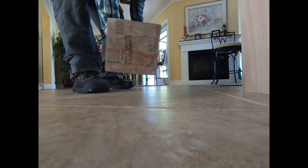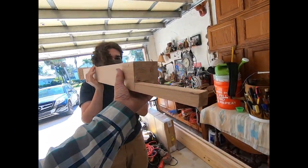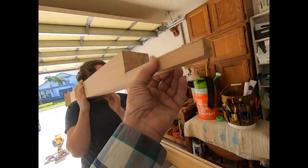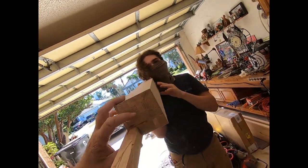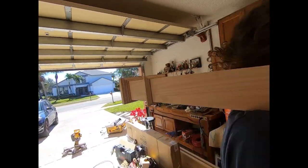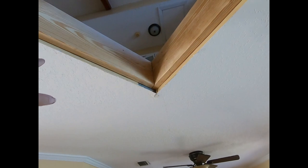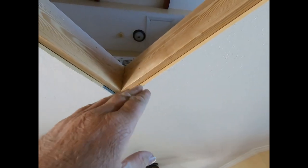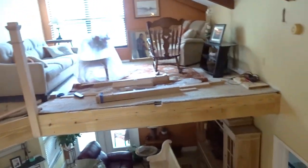We have our post minus the sleeve, and these are solid red oak. When I say solid, I'm literally talking solid post all the way through — you don't see that too much anymore. This is the post that we basically notched out, left a quarter on both sides. It'll sit on the corner upstairs. Let's go take a look and see what it looks like when we put it in. It'll sit halfway on top of this stringer and halfway on top of that one, right there on that corner. Some really, really nice posts. We got a dry cut, we're about to install it.